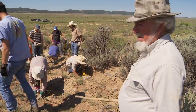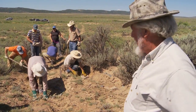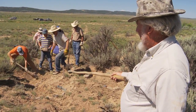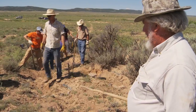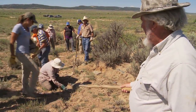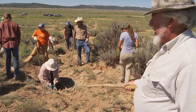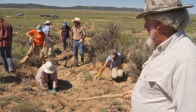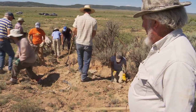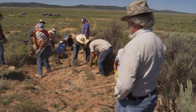We're building a rock run-down to stop a shallow head cut that's working its way up valley right here, and this would be the top edge even with where the top of the head cut is. We're using smaller rocks to match the natural ground line so we can increase the growth and vigor of the grasses at this point right here.